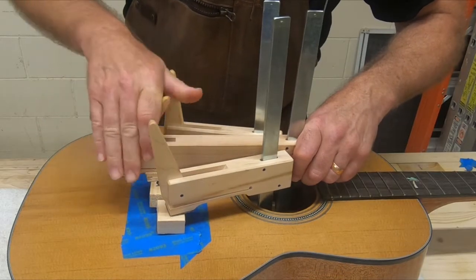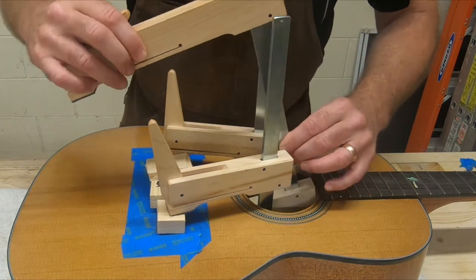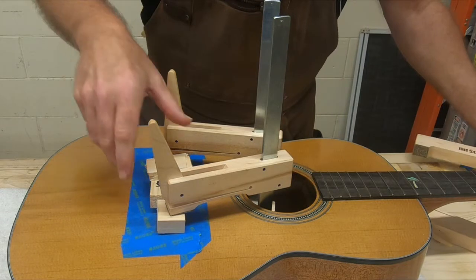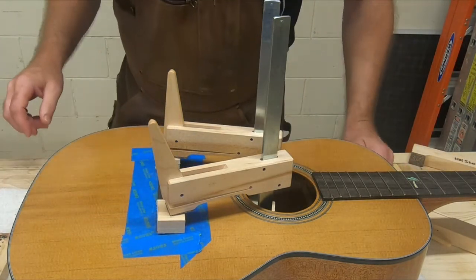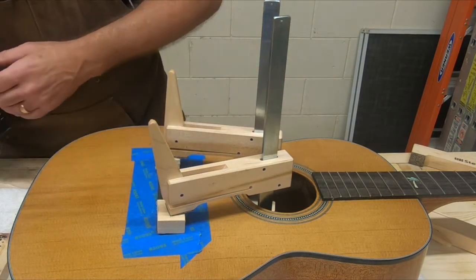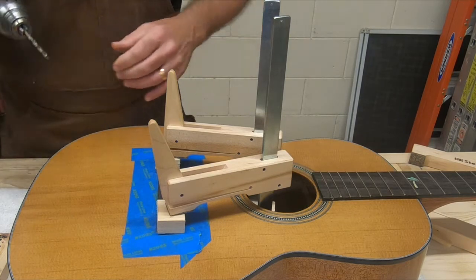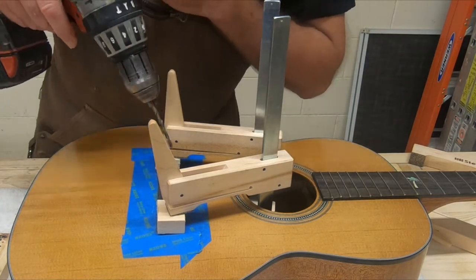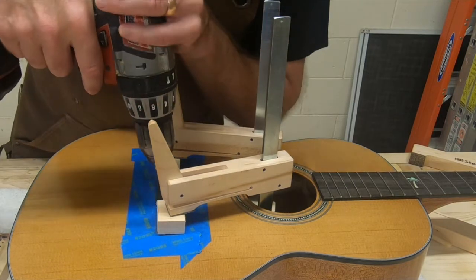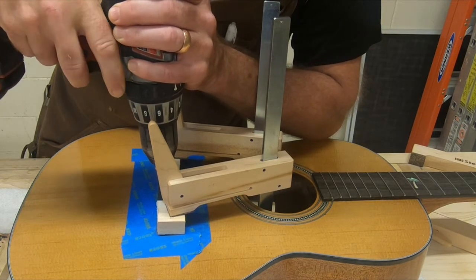All right. Good morning. We are going to just take off the middle brace now. And that's tricky, I think. There we go. And then what we're going to do, we're going to leave these on and we're going to drill out the holes. I got a 3/16 inch bit here. And what I'm going to do is first, I'm going to start in reverse to help avoid tear out. Hold this down while I do it. I'm going to go slow.